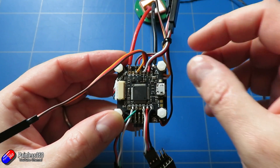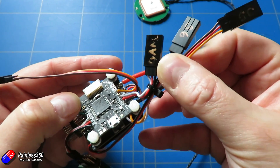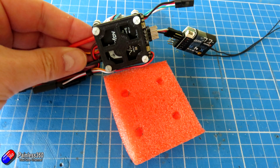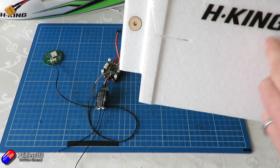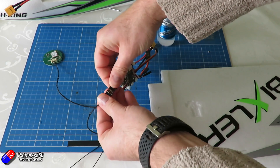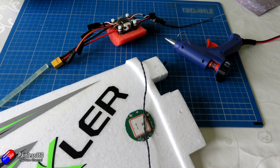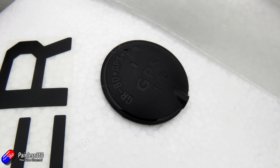There's only one set of soldering connections left — soldering the ESC to the back — but first I need to mount the flight controller on that piece of pool noodle. I've cut holes corresponding to the mounting screws and applied hot glue where needed. I'll put the 3D printable parts I've designed for this rig on Thingiverse — check the description to download them. Next job is to install the GPS into the other wing from the FPV bits. I've cut a small recess so it sits flush, using hot glue to hold it, and the original cover from the enclosure fits nicely on top, secured with foam-safe CA glue.